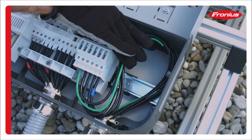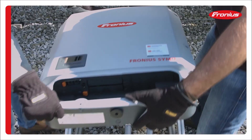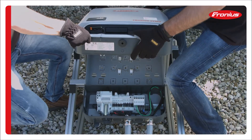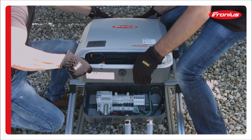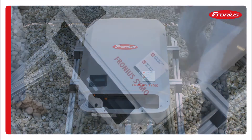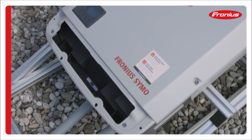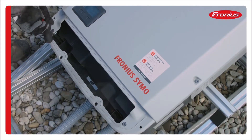Make sure that there is nothing that will prevent the inverter from swinging and mating with the mounting bracket. Take special care that your conductors or communication wires do not prevent or block the inverter from closing and properly seating to the mounting bracket. Tighten down both securing screws using your adjustable torque driver set to 1.8 foot pounds.